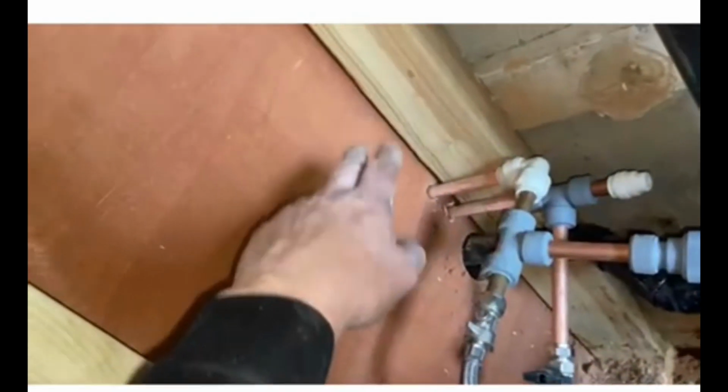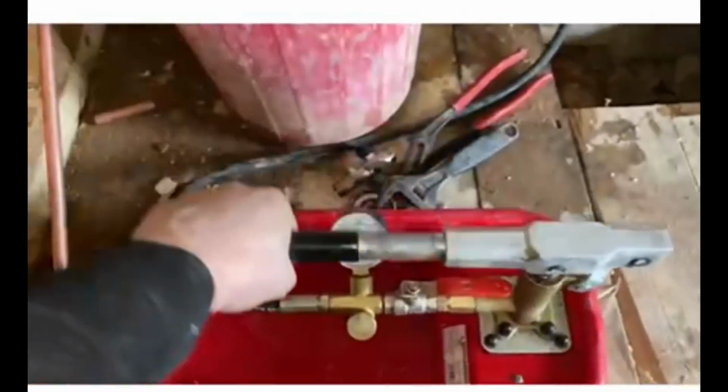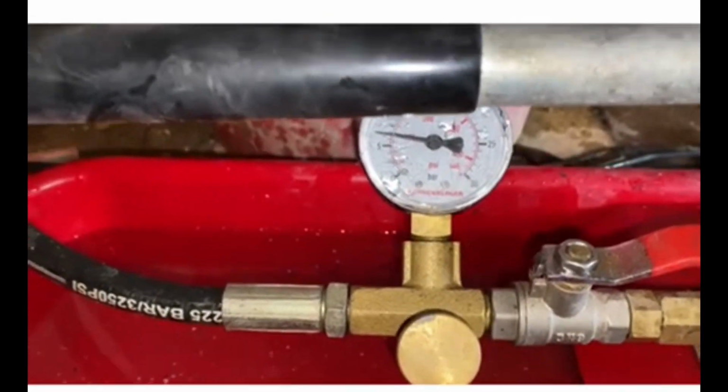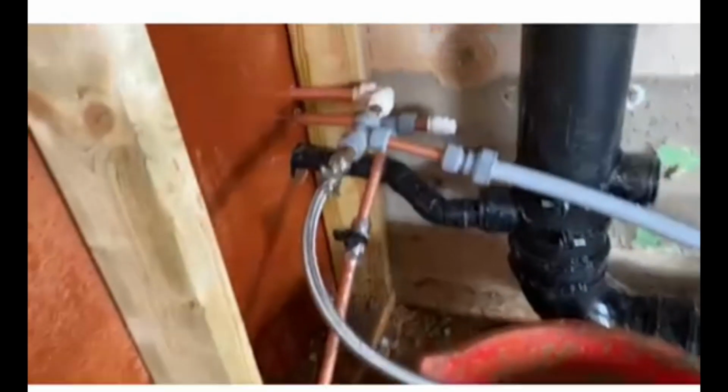And then, like I said, the mains here is rigged up. We're on the building site, as I said. Cold goes into the hot, it links upstairs where I showed you, and it comes back round on the hot, and then once that's pressurised, and then pump it up to 6 bar here. This is what I'm doing at the moment. So 6 bar, it's all isolated, we'll leave it there now. Testing at 6 bar, and that is a good water test of your pipes.